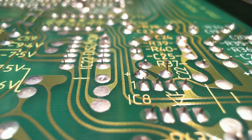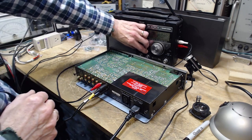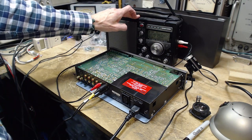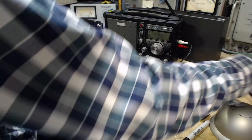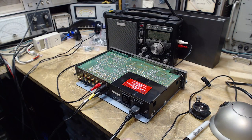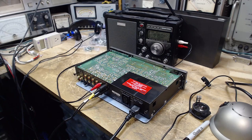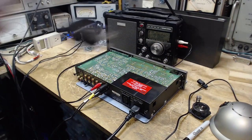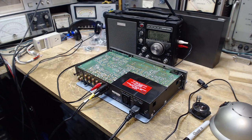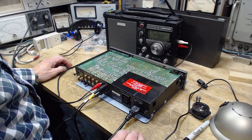I have to test this unit now to see if that was really the problem. This radio is going to be the source - I'm going to use it as a battery-operated radio, not plugged into the wall, so it cannot be a source of hum. The output of this is connected here on the radio input, and these outputs go straight over to my sound system. I'm going to have this plugged into a regular outlet and then listen to it straight into my sound recording system - hopefully we can find out if the dead channel came to life.